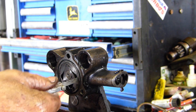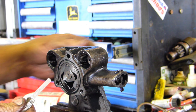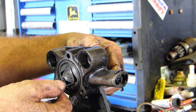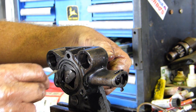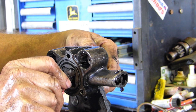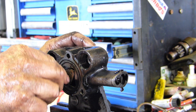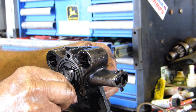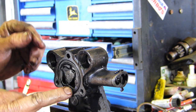We can measure down the side of the housing here. That's ten thousandths of an inch between the rotor and the outer. Yeah, that's an easy tenth there in between the rotating assemblies. I reckon five's the maximum in there - this may be a little less, but there's an easy tenth there. Between the outside rotor and the housing - I'll go and look it up now. I'm pretty sure it's five, I'll be back in a second.